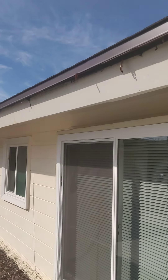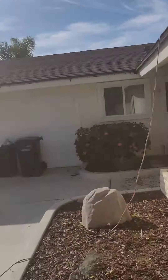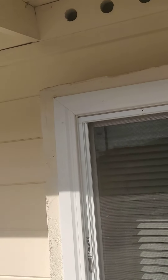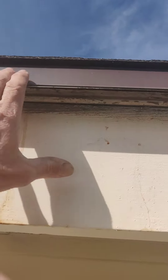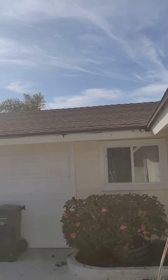Most of the problems I see with the roof I can spot from the curb, because if you've got gutters on your house and you've got active staining coming from behind the gutters, the first thing you look at is the relationship of the flashing to the shingles. You can usually lift it up, and if the paper is underneath the metal, then you have roofing failure.